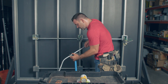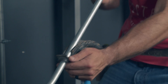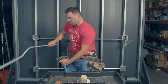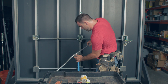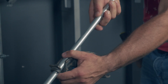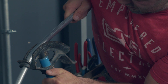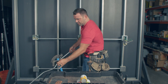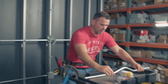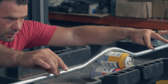So I go through and bend the 45, slide it in, rotate it so it doesn't dog-leg, bend the 22 and a half, then flip the conduit the other direction, go to the mark at the arrow, make sure it's lined up to avoid dog-legging, and bend 22 and a half. Infinitely better than last time.